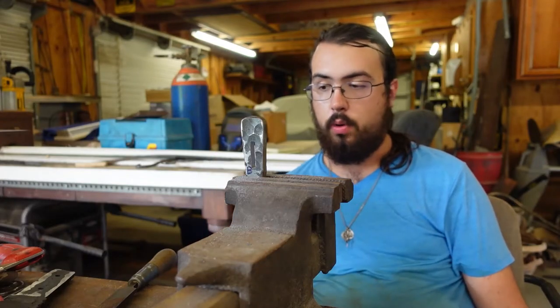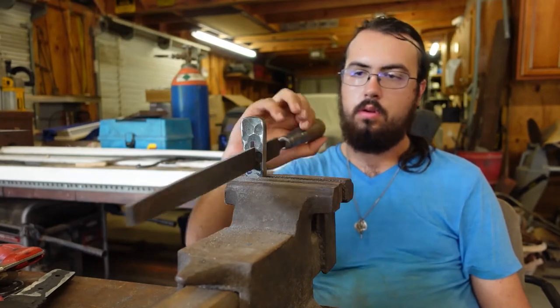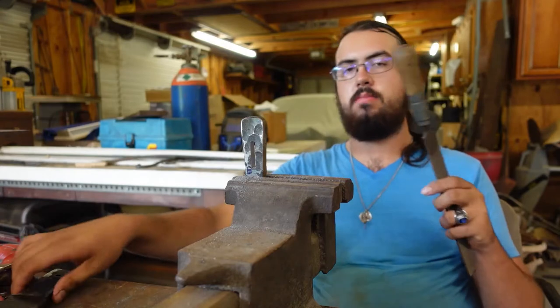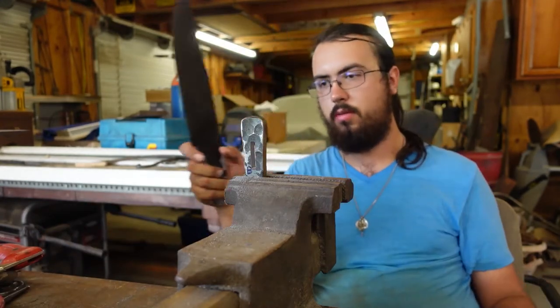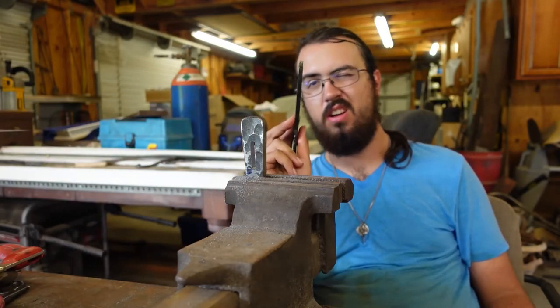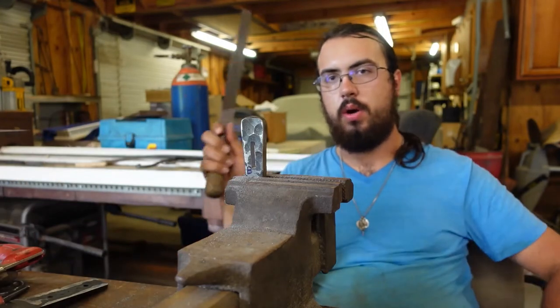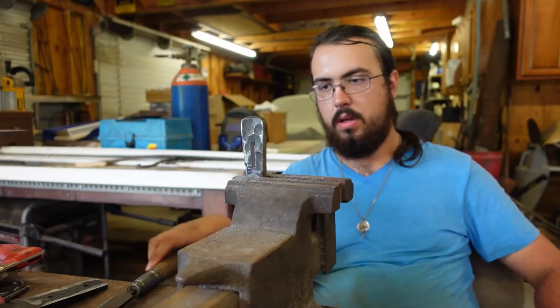This for quite a while. I obviously have this big file fitting in, which looks to me to be about the same size as the tang at the spot where the guard will fit. However, some spots of the tang are thicker than that, I think, so I need to grind that tang down a bit more than I did already.